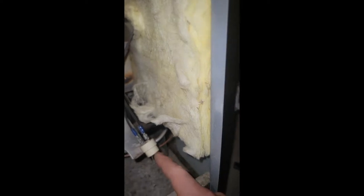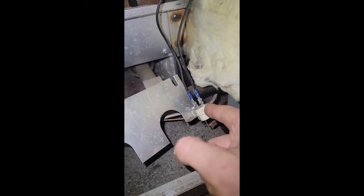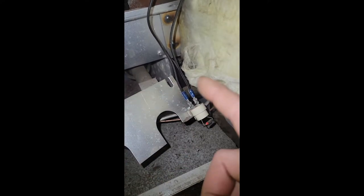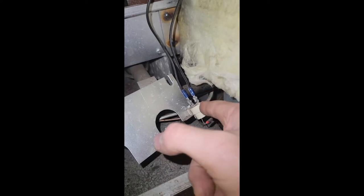We're going to try to relight this thing. This is very important — if you technicians ever walk around a boiler and see this switch jumped out, bypassed, or removed, don't work on that boiler. This switch should always be actively in the circuit. We're going to check it out to make sure that switch is fine — it is basically the safety rollout switch.